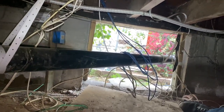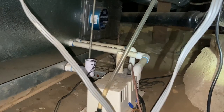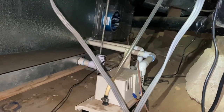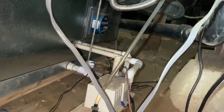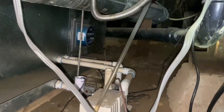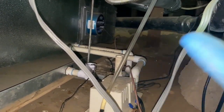We're back under the house - total pain to get under here, about half those wires got stuck on me. They have a smart thermostat and it gave them a report saying the system turned off 19 times before hitting the satisfied temperature, which tells me a drain switch was tripped or something.